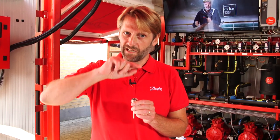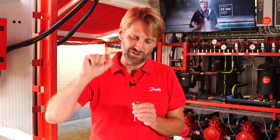Making a safety valve — or even a prototype that works — is not particularly difficult. What matters to you as a customer is having a manufacturer who can produce one valve after another and still have them performing as specified. That requires very good quality assurance in production. In our design, we know exactly how our tolerances should be, and we have communicated to our suppliers that they must supply parts with a very narrow tolerance and what is called a high cpk value.